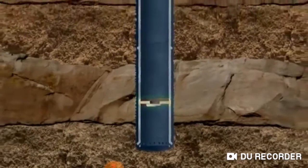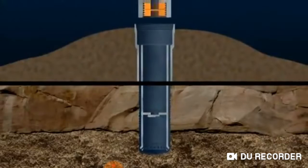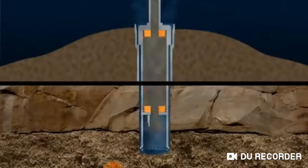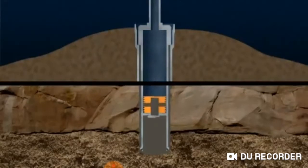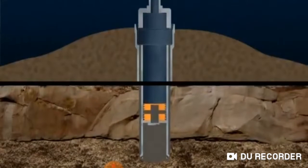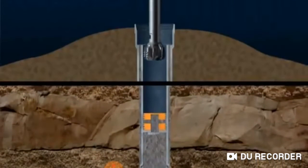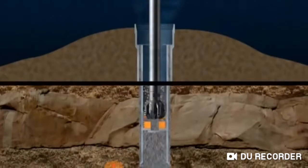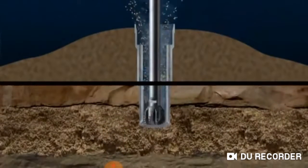A cementing tool is connected to the top of the conductor. A plug that pushes the seawater out is driven downwards by high-pressure cement that fills the conductor. On reaching the float collar, this plug is ruptured, and cement flows out of the bottom of the conductor and up the annular space between the wellbore and the conductor. The cement plug tool is removed, and when the cement has set, drilling continues with a smaller diameter bit, penetrating the cement plugs and float collar and into fresh rock.